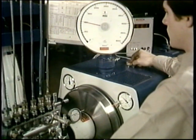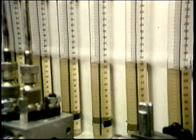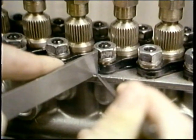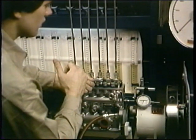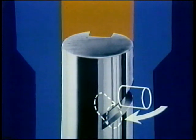Take a draw at the specified speed and rack travel. Number three and number one are under the low spec. To fix that, rotate the barrels — but first scribe the flange setting of the barrels you're going to change. With the nuts and lines loosened, rotate the barrel to increase delivery. You're moving the port in relation to the plunger helix, so port opening will come a bit later. That increases delivery.